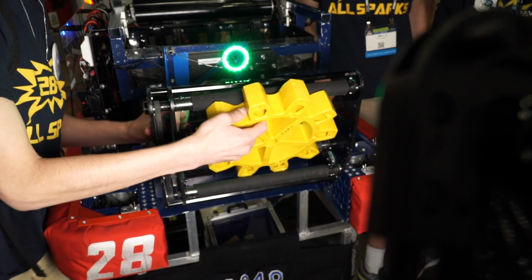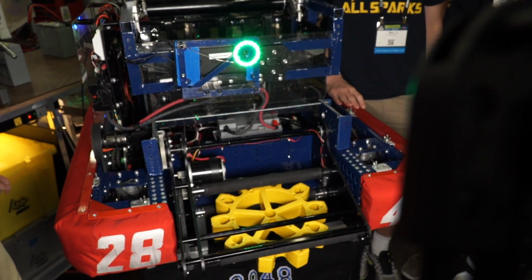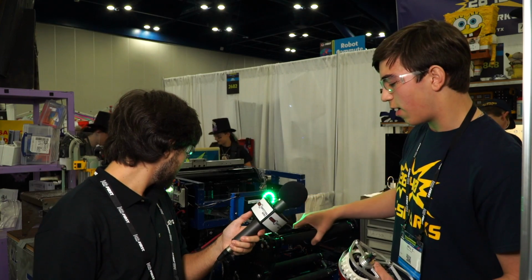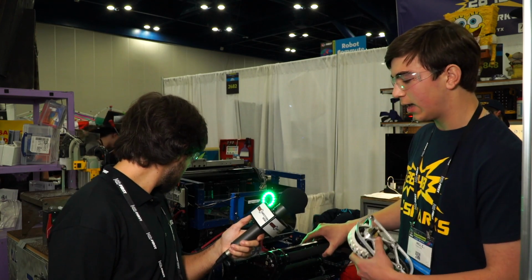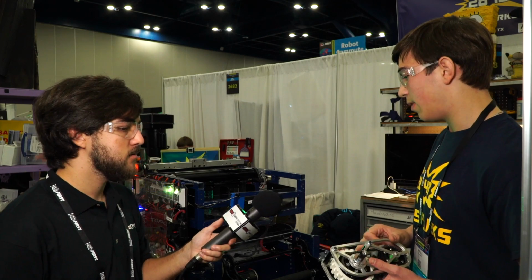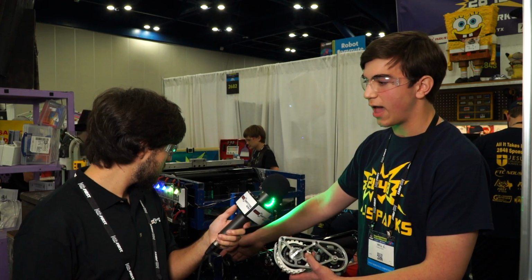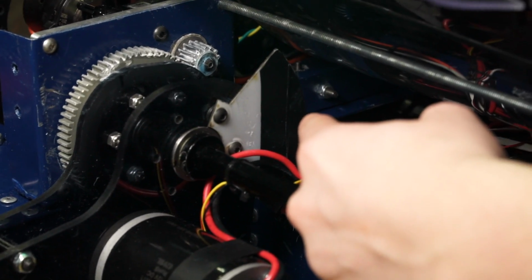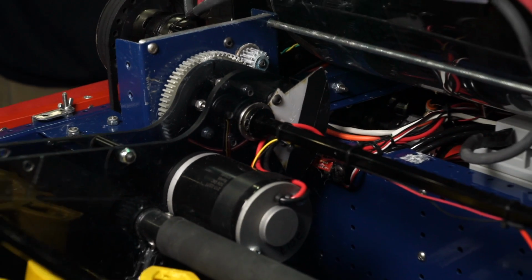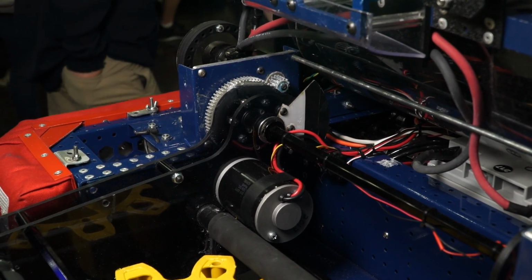And so we actually have 3 sensors on this one. One is an encoder to track the rotation of it. So we actually have a position for starting position. We have one for the camera to be able to see the peg. And then we have our intake position as well. We also have a photo gate sensor, which detects when it's being broken by a flag that we have here. That basically acts as a virtual hard stop so that we don't ram into our frame and we just stop at the up position. It also resets the encoder for the rotation, so we're always accurate.